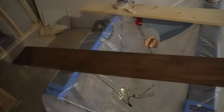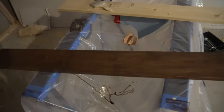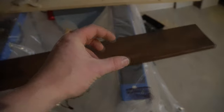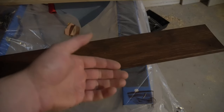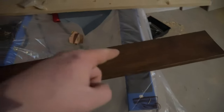So don't do that. All I would suggest doing is measuring out your wall. That's why I said 4 feet, because if you have no wood within a 4-foot span, throw your house away. That's really not good. But what you might have is steel stud, which in that case you would need steel stud anchors, which I suggest Hilti toggles. I don't have any here to show you. You could just use metal screws and try and go with that and make sure that it's actually made for metal, self-tapping screws, so that way it'll self-tap into your steel stud.